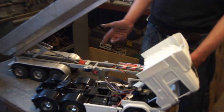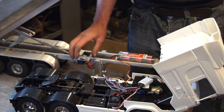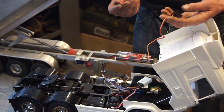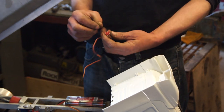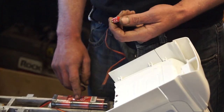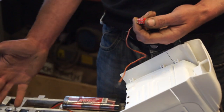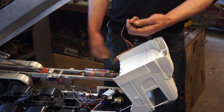I don't actually use speed controllers on my mechanisms and trailers — I use a servo and a double pole switch. What this does is you feed the power from the battery, whether you take a battery on the trailer or take a jump from the battery on the wagon. If you're using a big enough battery you can just run wires from the wagon battery down to the trailer through banana plugs.